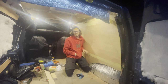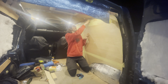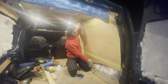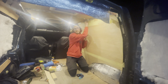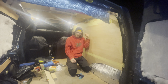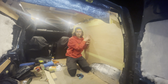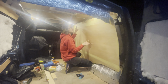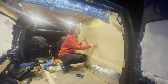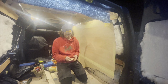I've had second thoughts on using screws to hold it up. The screws can only be so long because the battens behind are 9mm thick. So the screws can only be 12mm long, and I'm just not comfortable with how little bite there'll be on each screw. So my solution is actually rather elegant, although I say so myself. My solution is to use some T-nuts.